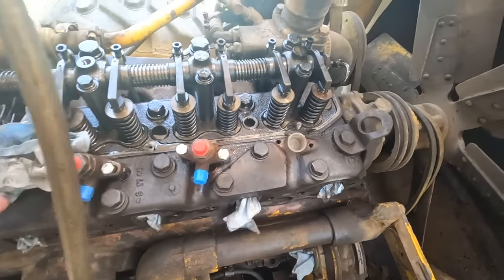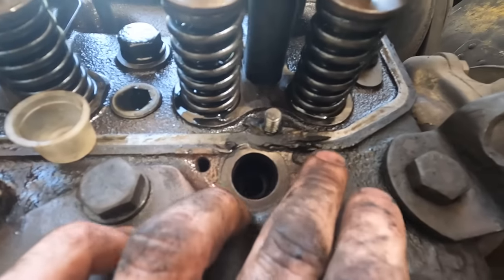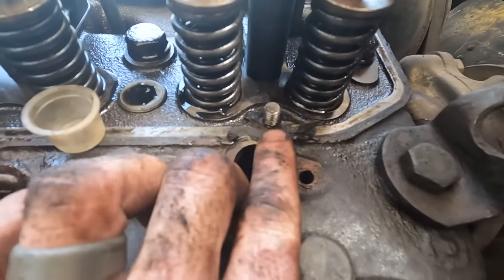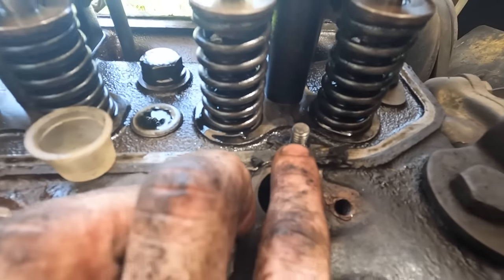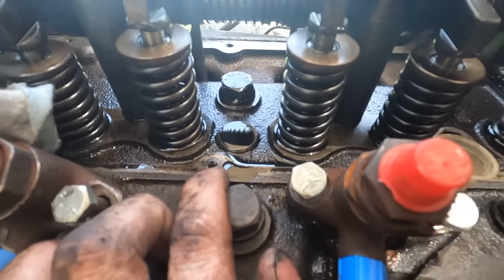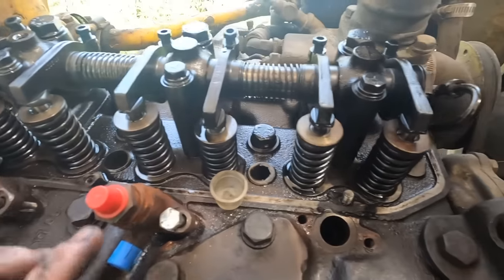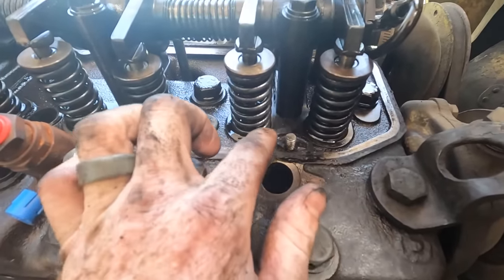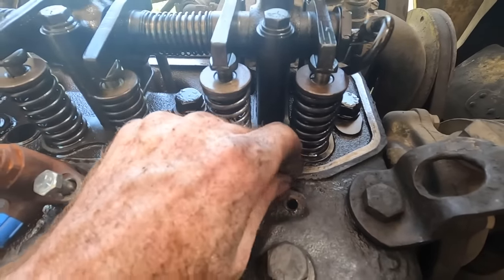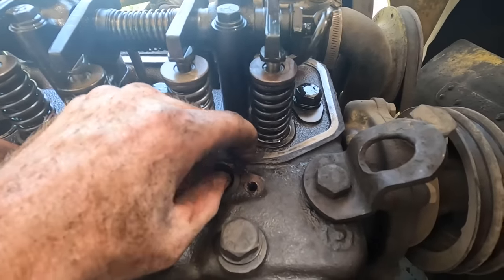Okay, I figured it out. So there's a bunch of RTV right around this spot where the valve cover seals. Well, you see that? There's a stud in there, and it's actually half inch. All the rest of these are, I think, the heads are 7/16, but they're quarter 20. That is not that way. It's bigger. And so it's welded in there. So this RTV here was added to just try and give it a good seal.